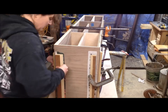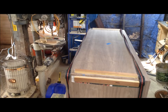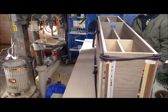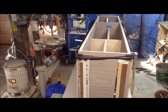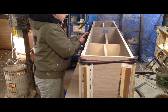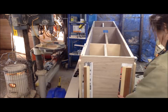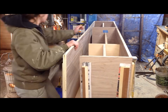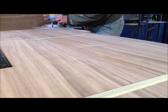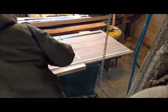Then it was just a matter of getting everything in there, checking that all the cubbies were square, and attaching all my straps. This cabinet is going to have sliding doors on one side, so before finally gluing it together I wanted to cut the grooves for those doors on the bottom panel — it's much easier to cut these with the panel off. The grooves are half-inch wide and about an eighth-inch deep, cut with a half-inch straight bit using my plexiglass router jig. I have a video on my channel showing how to make that jig.